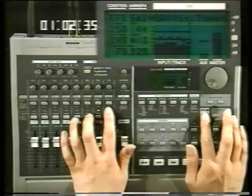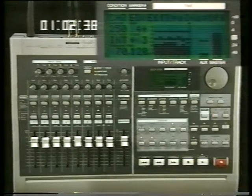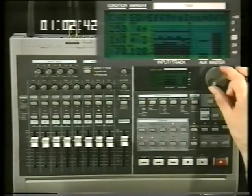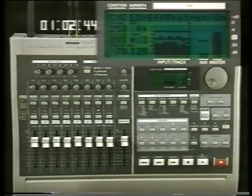So shift, channel edit 8, effect 2, one step to the right, and we see EQ effect pre-insert. If we switch this on, then we can do exactly the same thing, insert the effects in exactly the same way, but this time the effect will be recorded to the disk drive so that when we come back and listen to it, we can reset the effects and use them for completely different functions, but we'll still have captured the sound that was applied originally.